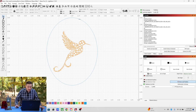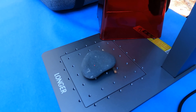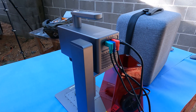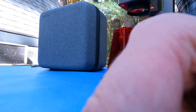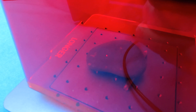I'll zoom back a little bit. We're going to see that I also drew an oval, which is roughly the size of the rock for today's project. When I click on the Frame button, it kind of shows up all around on the rock, which is a pretty good way to get things aligned up. From here, I'm going to shuttle the laser head up by pushing the Up button, so that I can get the laser shroud in place and protect my eyes — that way I don't need to wear any safety goggles. There are going to be two red dots visible through the laser guard, and I'm just going to lower the laser head down until those two laser dots converge to one point.